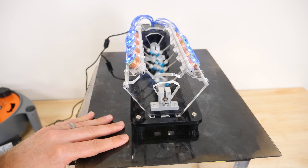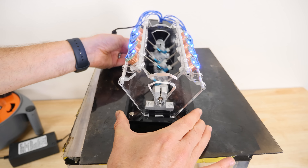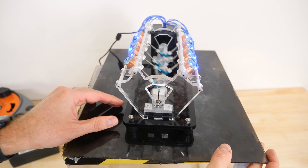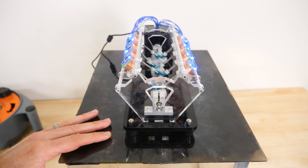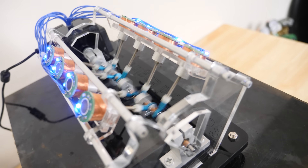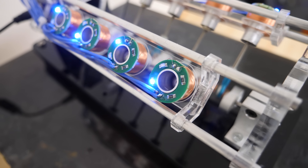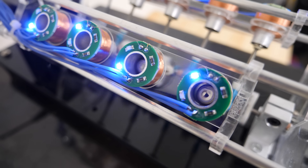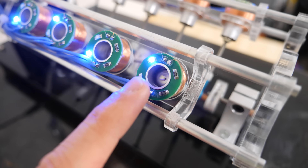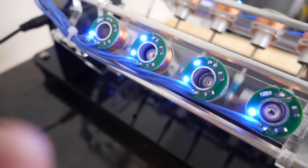That is awesome. Instead of pistons we have a permanent magnet that moves in and out of the coils of wire. When a current is applied to the coil it creates a magnetic field that opposes the permanent magnet and pushes it down. And once it's removed it turns off the current in that coil and it only turns back on again once the magnet is back in the coil. These LEDs are indicating when the current is off and on in each coil of wire here.